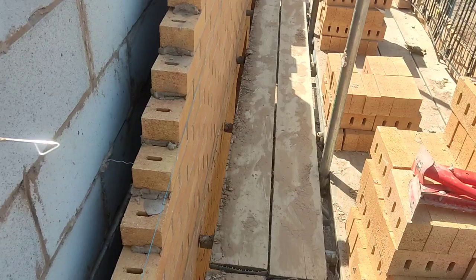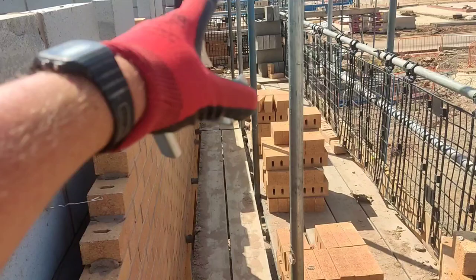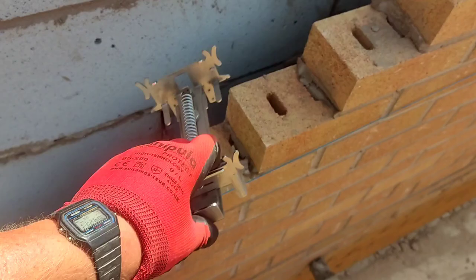Now, obviously I've built this in a big rack. People tell me all the time, why are you racking back? It's priceless, just being able to build a gable or build a back halfway. And now this fix brick can go on. Tension the line, bang it into a brick. I couldn't reach the other corner, but now fix brick all the way up your rack.